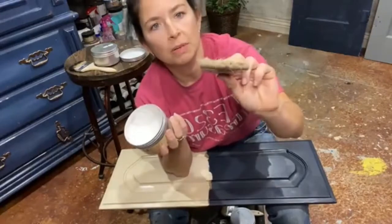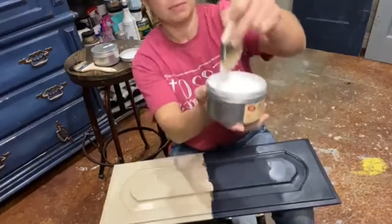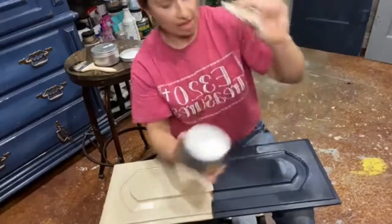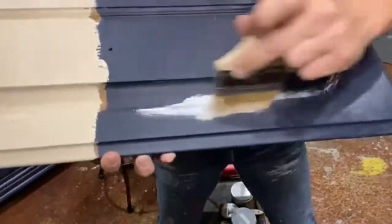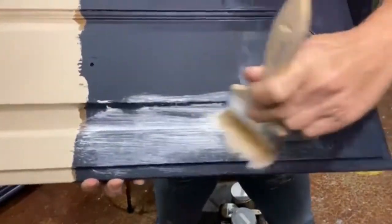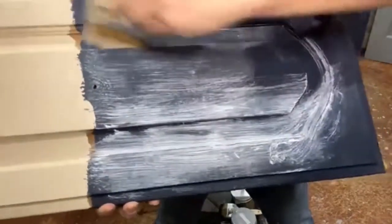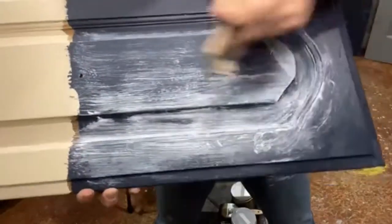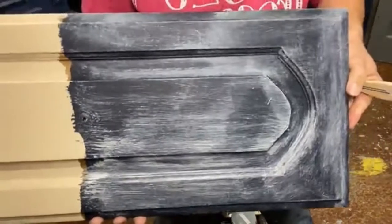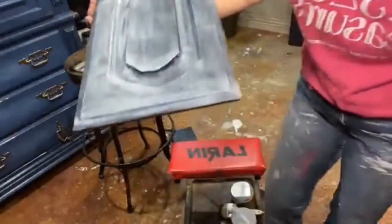So we have our Best Dang wax in white. I'm just dipping my chip brush in — you don't need a whole lot. We're just gonna go and apply it all over. Get in those little creases right here. The creases are the best for wax because it settles in there and just gives it such a great dimensional look. We have a full application of white wax. I always use a lint-free cloth so when you're wiping your piece you're not leaving hairs and dust particles.